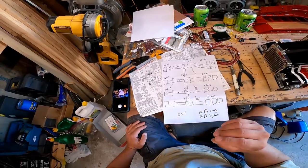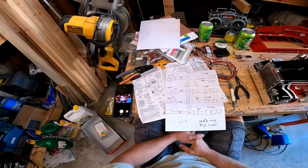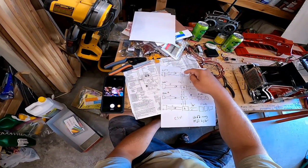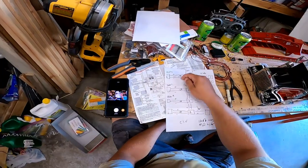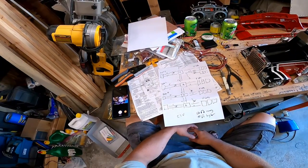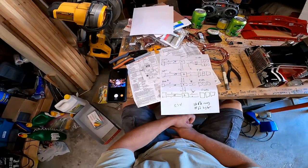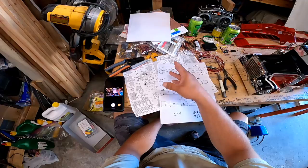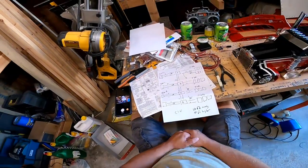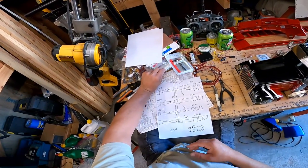Now, here are some complications. First, from what I read, you can't just do this and expect that board to be okay with it. Some kind of voodoo magic happens, and you have to put in a protection circuit, which uses a Zener diode or a switching diode, going kind of backwards from the way you normally would, I guess. Somehow that makes it okay. I don't have the full understanding of that, but when this switch goes on and off, the immediate power cutoff builds up something that needs to be able to flow back. So that's a thing, and that's what I'm going to do. I have some of those. Let me give you the part number and show you what I'm talking about.